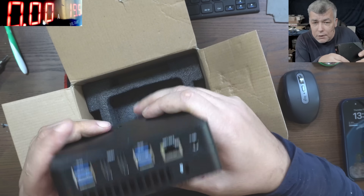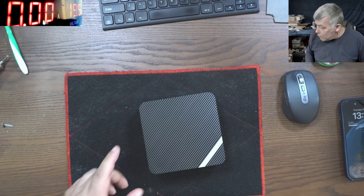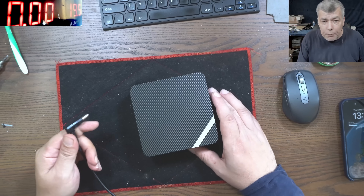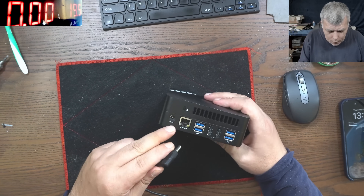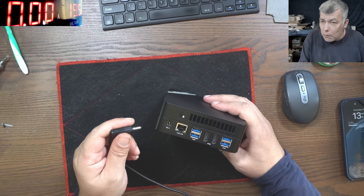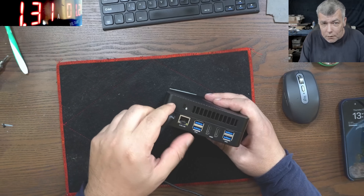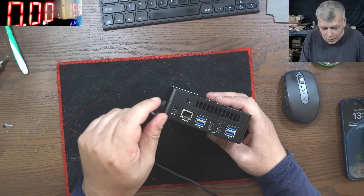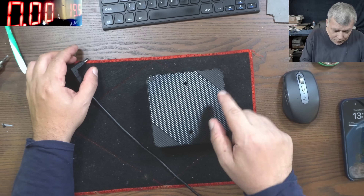So what do you think — can we fix something like that? Let's see. We need a charger, I need an adapter for my power supply. We have the power supply on screen: 19 volts. This is shorted — so check that. Check the power supply: the voltage is going down to 1.2 and the current is going up because that's the limit, probably around 1.3 amps. This one is completely shorted. Let's open and have a look.